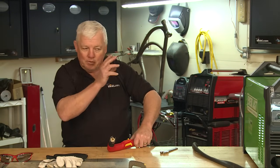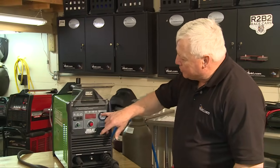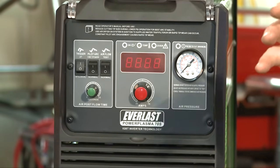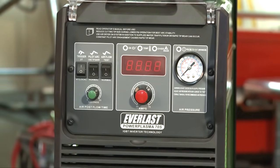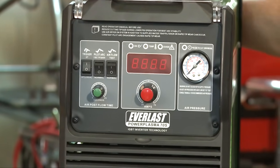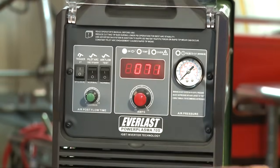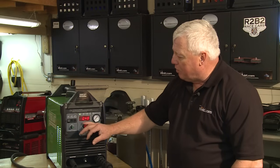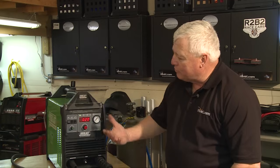Now I'm going to walk around and show you — there are only a couple of settings on this machine. There's a setting for air, which we'll turn on in a minute, but this is probably the most critical part: this machine will not work until you reach about 35 PSI. The instructions give a range of 35 up to 75 PSI, so you can get some pretty good force through that tip. This right here is the amperage. It's a 70 amp machine that'll cut some pretty heavy duty material. When I'm doing sheet metal type work I'm somewhere down into the 20 amps, and it'll cut 16 gauge — so you can see there's a vast range.